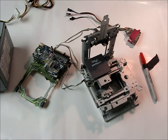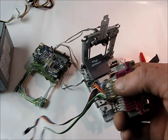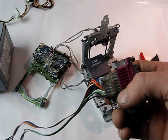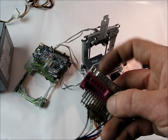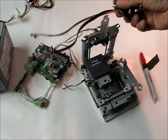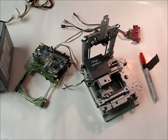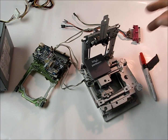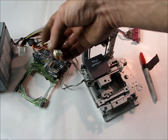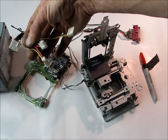I've connected our last pins — we only had one and two hooked up before, and I've now hooked up the last four, so we have six here and then three grounded on the bottom. That's our printer port done, and those go into the print floppies — as we know, pins 18 and 20. I've also split this into three so we can hook all three floppies up.